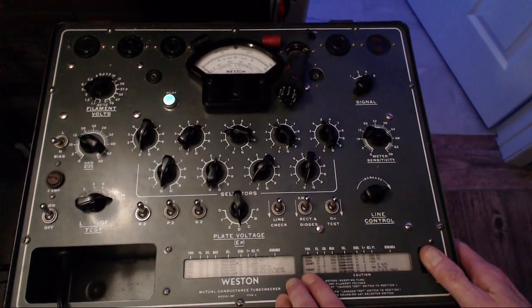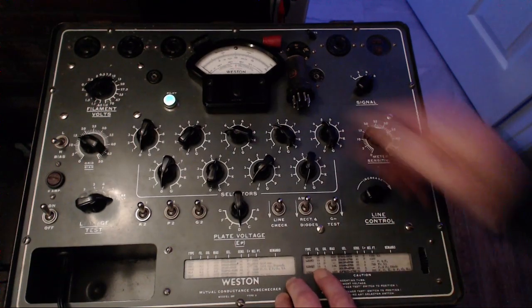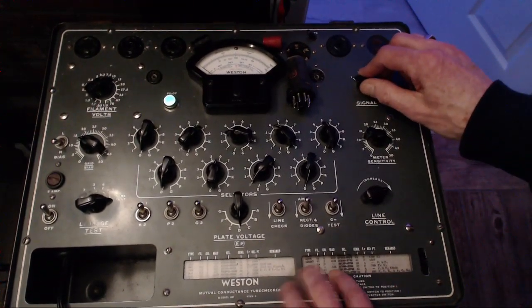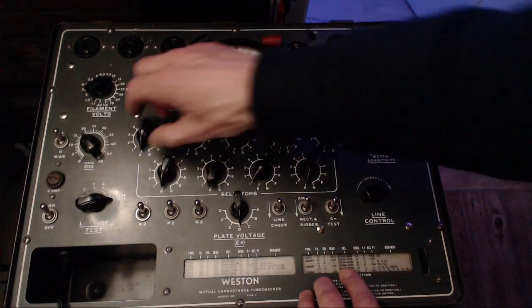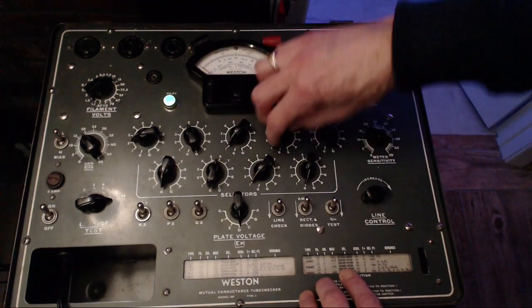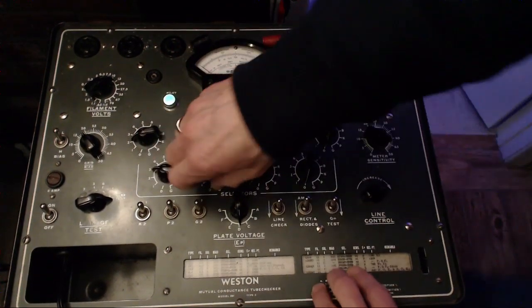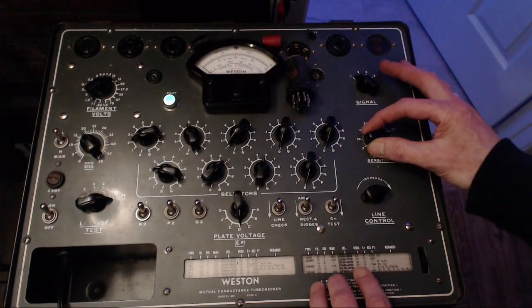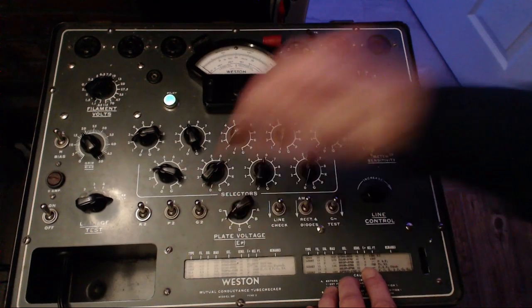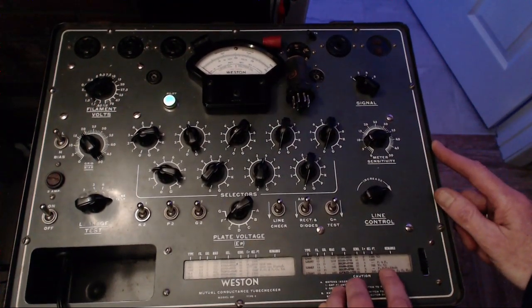12 SQ7. 12 SQ7. 13 volts, correct. Signal level 1. Bias 18L. Okay. 25100. 3760. Sensitivity 37. F. Should read 760. That's the reject point. Should be above 760 or throw it away. And so first thing we're testing is the triode side of this tube.